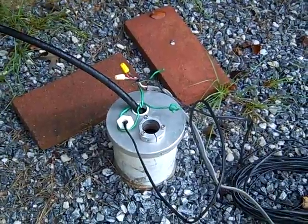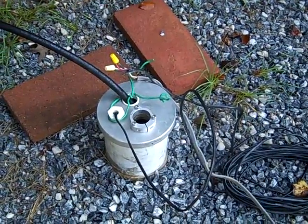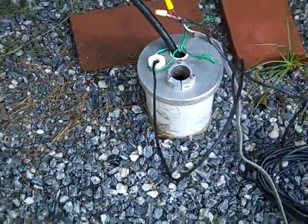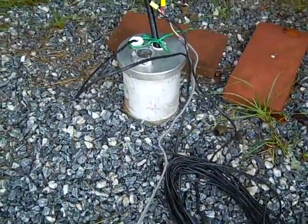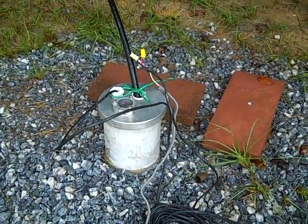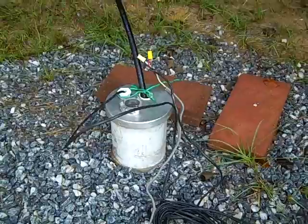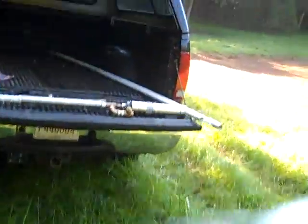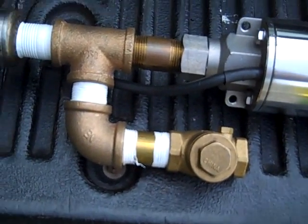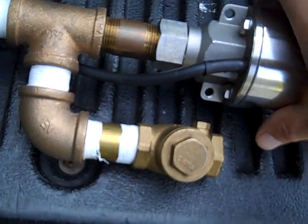You can contact me or PM me if you're interested in any of these, because I do design these systems and can help you with yours. This is a standard commercial well — 300 feet deep, static water level at 25 feet, producing six-and-a-half to 16.5 gallons a minute. So even with all those pumps in there, I will not out-pump the capacity of the well.